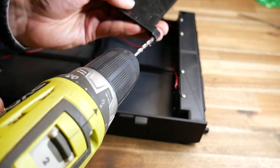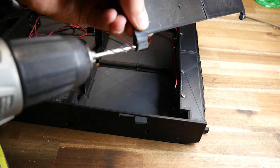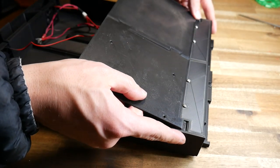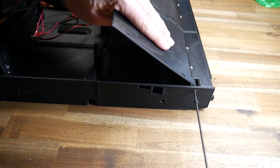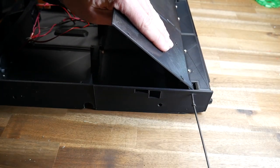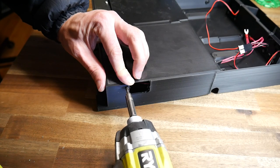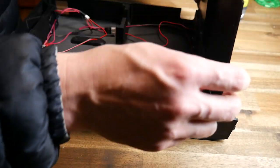You might like to get a 3.5mm drill bit and drill out the two hinge holes on either side of this top lid. Now we can guide the top lid assembly into place — this time you're going to want two M3x30mm bolts. Carefully align them by hand, and then feel free to switch to power tools to drive them home. Your hinged lid should be free to move up and down at will.